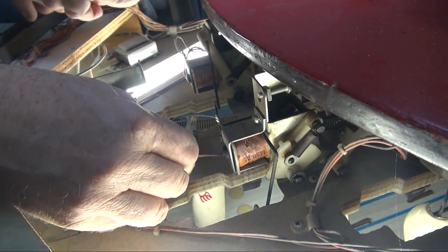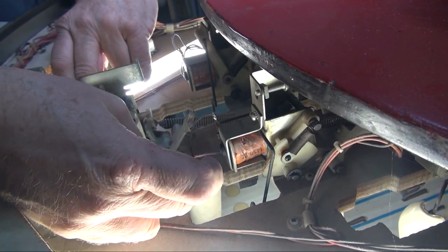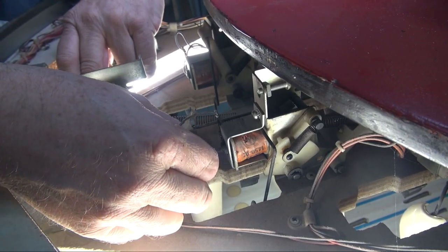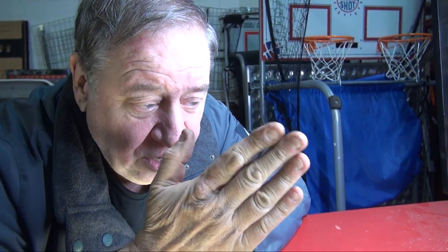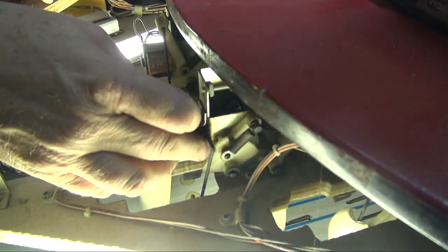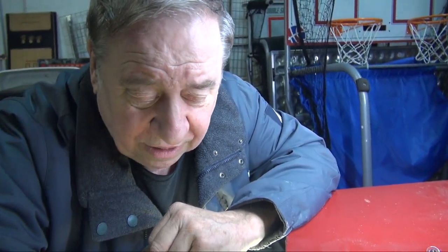See? Okay, now, this one coil, the last wire in the circuit, is the red wire. Okay, and it's attached. So if the pin before it, which is back here, is working, if the red wire came off of one of those pins, then anything after it wouldn't work. Sort of like if a light bulb on an old Christmas tree string, all the bulbs after a certain light go out. But the chances of the coil being bad are almost zero.